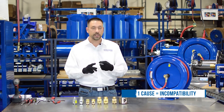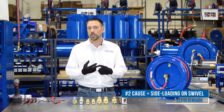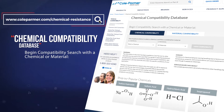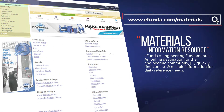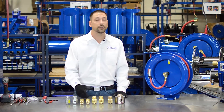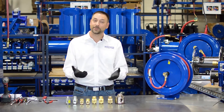There are two major causes. Number one is incompatibility — the fluid inside your product versus the seal that you have — and number two is side loading on your swivel. For compatibility, there are two websites we go to when someone calls: Cole-Parmer and eFunda. You can go there and check whatever fluid or material you're flowing through to make sure it is highly compatible with your seal. For example, the number one failure in the field is hot water with nitrile. Water and nitrile are fine together at ambient temperature, but once you get hot, nitrile performs badly and you should really be using EPDM. So if you're running hot water, get an EPDM seal and you'll have much less problems and fewer leaks.